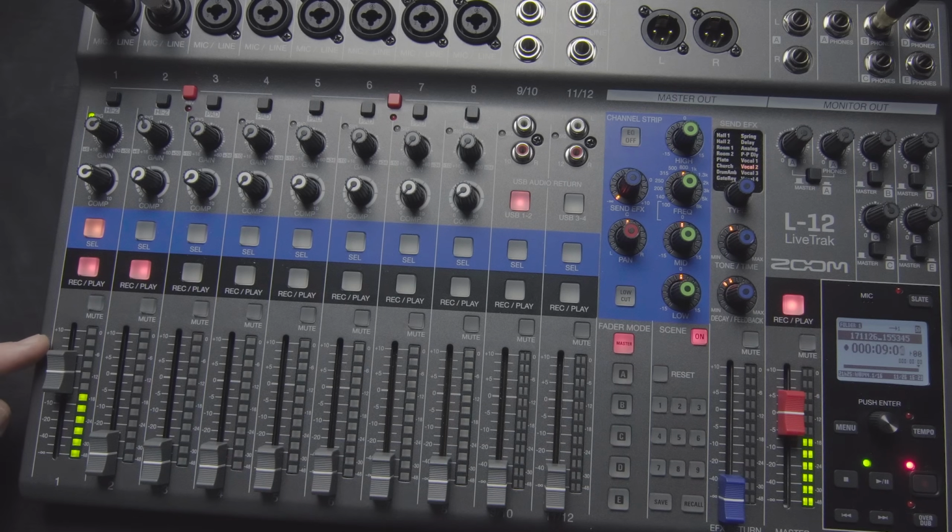And then you have the audio meter with the fader, which gets pretty interesting. I really like the resolution on the audio meter. It's 12 LEDs deep, so you can really tell where your audio is at. So that's a big key for me. And you can see we have +10 on this side down to infinity. And then on this side, we have 0 down to -48.